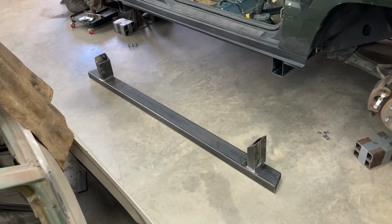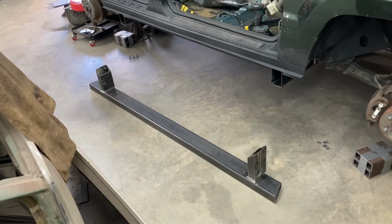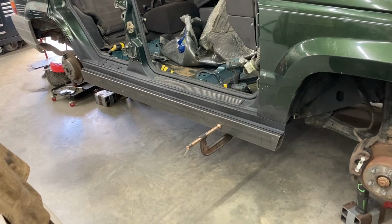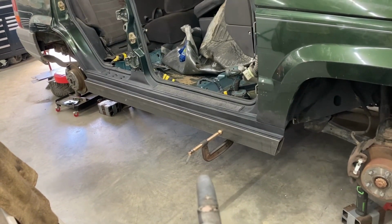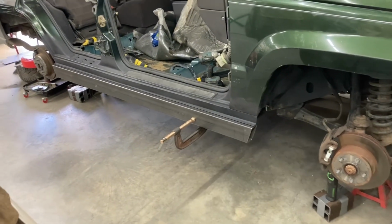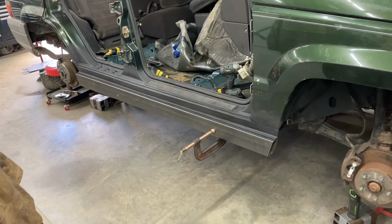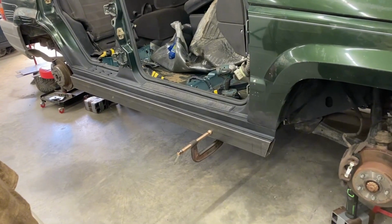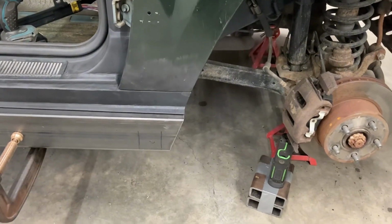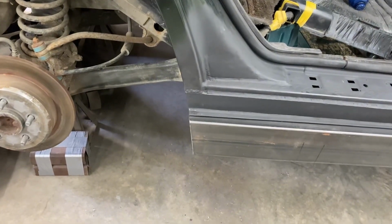We've welded the stubs on the rocker slider here. We've trimmed the ends. We'll slide it into our receivers and see how it fits. It slid in real good, but I admittedly had to put that clamp on there and lift on the handle to tweak it, so the third bolt would go in both the front and the back. Other than that, it goes in and comes out real good because we've got that clearance in there. There's our profile for the front, and there's the profile for the back there.